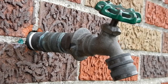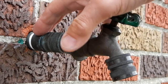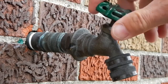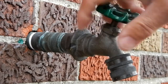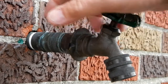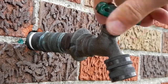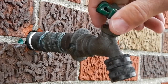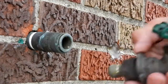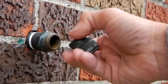The way this would operate is you'd go downstairs, open up the valve that's in the basement, and this outside valve would be shut. Then you could come outside, open this up, and you'd have your water. When you're done, close this valve off, go to the basement, shut the valve off in the basement, and then come back outside, open this valve up, and let the water drain out. Then it's just a simple matter of taking this part off and unscrewing the garden hose adapter.